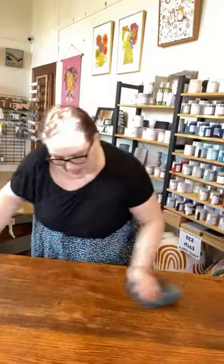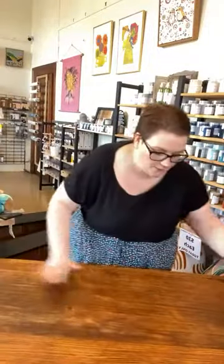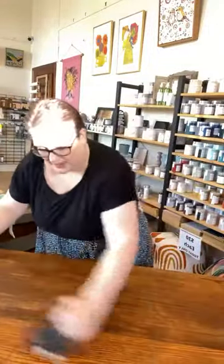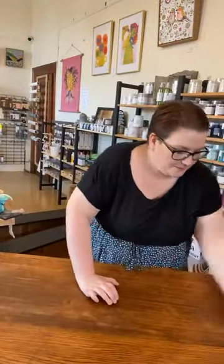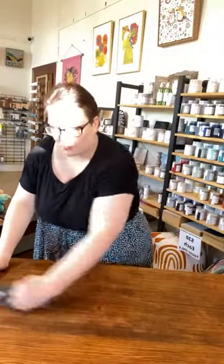Ignore that whole sentence. Tomorrow you will come back and you will wipe it again. Anything that's still sitting on the surface, it's not gonna soak in. Take it off, okay? If you don't take any excess off, you will end up with a sticky mess. I can guarantee you that. So, nice wipe down. Now as you're going, you may notice that your cloth will sort of grab hold of sections.